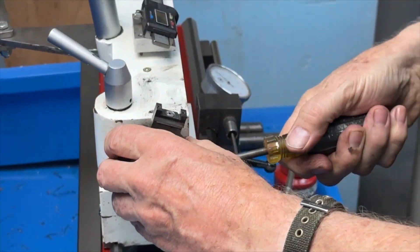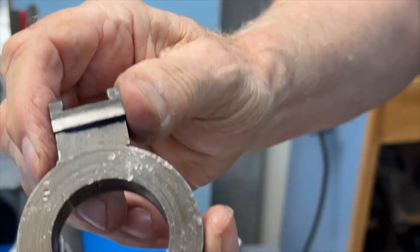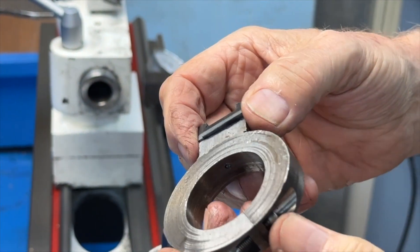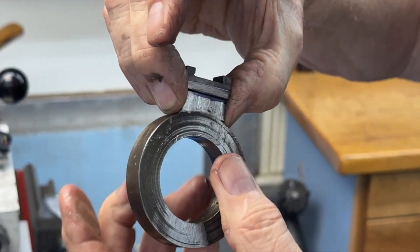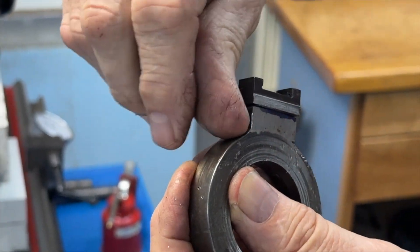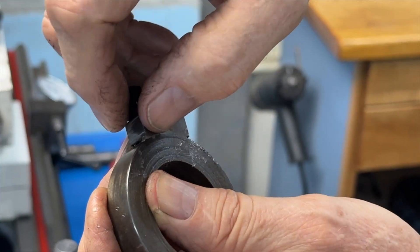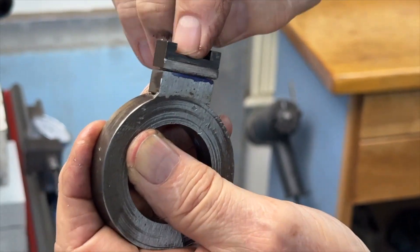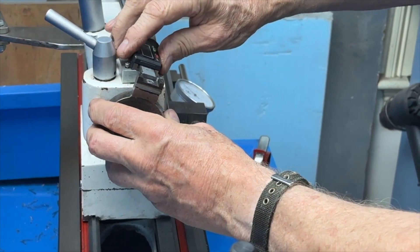All this is is a split ring that I machined to exactly fit on here, and then I put a tightening screw on it down there to tighten it. I silver-brazed this block on, but you probably don't have to — you could just bolt it on with a single bolt. What I would do is mill this flat and put in a square block. I made this curve to fit the curve, which is harder to do; it would be easier to just mill a square slot and put the block into it, then mark the height and bolt it down.